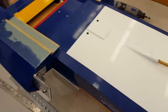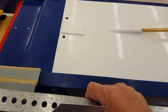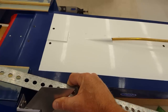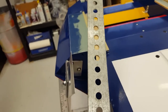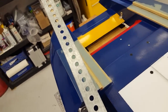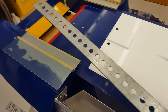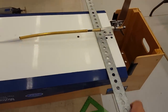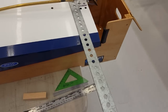How do you do it, what are you gonna do? I see guys do this all the time — they grab their straight edge, they put it on here, and they go 'well that's pretty good.' But the critical thing is where are you going to angle the straight edge, because you have angle in the fin. Put the straight edge on one way and it angles way in; put it on the other way and it angles way out. So where's right?